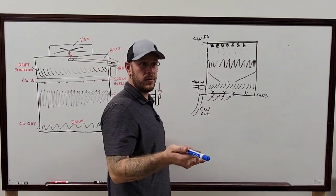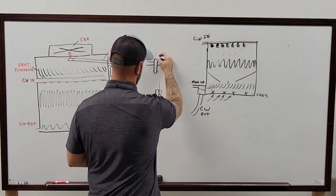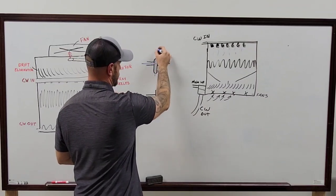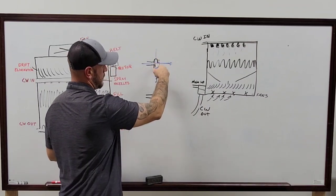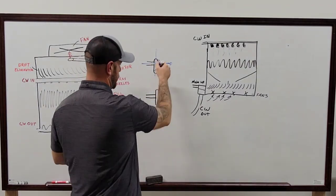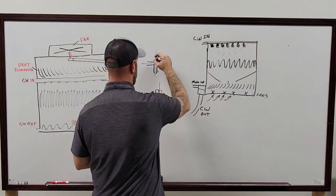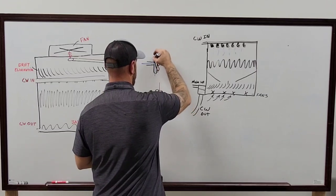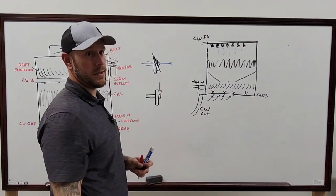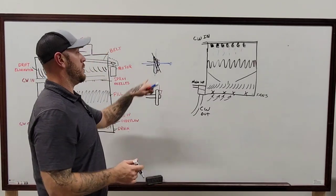Do you know what I mean by the zero with the pulleys? No. Okay, so when you're spinning one of these pulleys, what I mean by the zero, this is your axis, right? Yes. Obviously, line of zero, line of zero. You want that spinning on the zero axis. Okay? You don't want to see it through this. If your pulley itself is, forgive me for drawing it this way, off on your shaft like this, eventually that belt is going to walk itself off of there or snap or just wear all the way out. Or it can wear out that pulley.